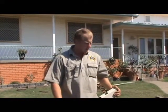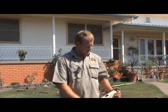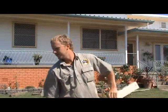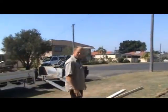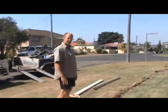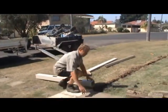And then of course, to work out the centres of the post, you add a half post each end, or in this case the full 127mm, to bring the centre of each post to 2 meters 450mm. So we know our post centres are 2450mm. Now what we need to do is find our starting point.